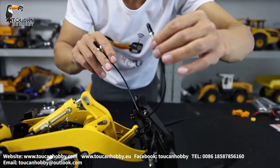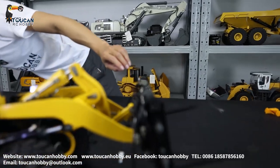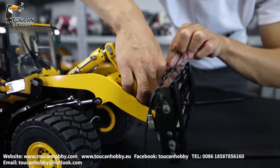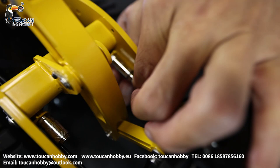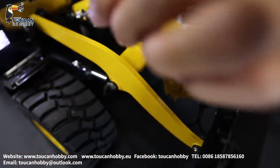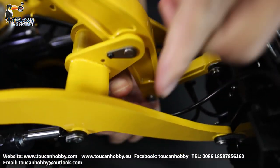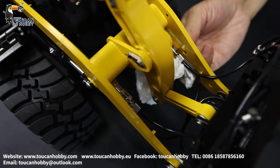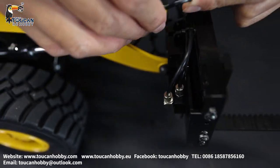Here we see we got two oil pipe connections to connect to the hydraulic oil system. Inside got a little bit oil - it's normal. So when we're connecting, we push inside this quick connection valve. You need to see carefully - this quick connection valve is locked. Otherwise we will be leaking. Now it's locked. Cannot pour out. So now we will not be leaking oil. Another one also get it connected. Push it in. Good. It's locked.